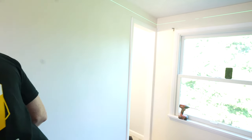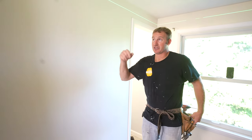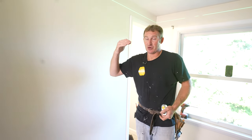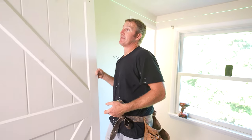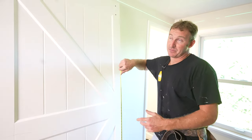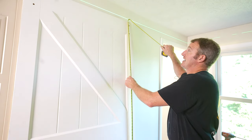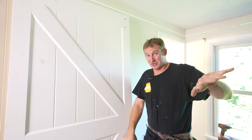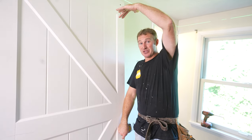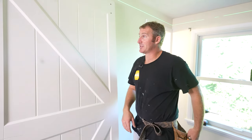It's a fairly easy installation. You have to pay attention to the model you're purchasing — I'll leave a link in the description below on what model this was. But all of them are going to be a little bit different. One thing about barn doors is typically they're much taller than regular doors. You want that so that you don't have to change all the trim around your door. This door is 84 inches. Most standard doors in your house are 80 inches tall, so they make it taller so that you can overcome the trim around your door opening. That's why this door is a little more massive than the rest of the doors.